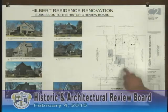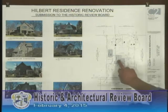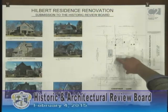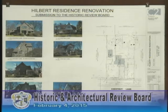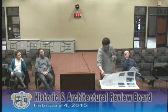If you look at the site plan, you can see the area of new work in the back. There's also an addition on the side facing the garage — a one-story. It's essentially a bump-out to accommodate the new kitchen and give it a little more square footage. So the piece that's currently there is going to be removed and incorporated into this two-story piece. The footprint is this hashed area plus that little bump-out. The width of the addition will change.